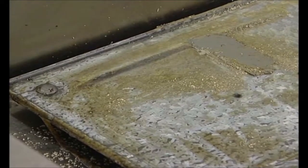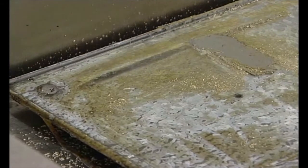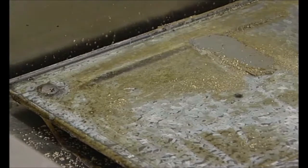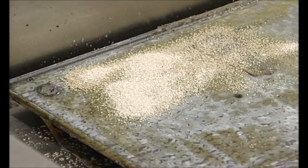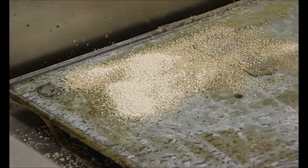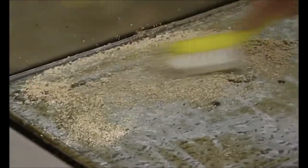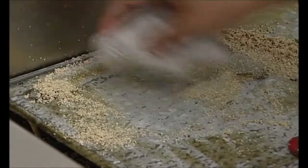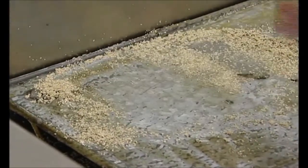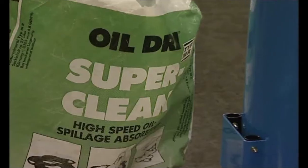When brushing the duct with granules inside, there's some abrasive effect, but the granule should only be used for liquidy type of grease and when there is no heavy accumulation, i.e. less than 600 micrometers, so that you can rest assured to get down to the bare metal. Your worst nightmare is that you only soften the top layer of grease into a liquidy format and a layer of sticky or tar-like grease remains underneath. The granules will then only stick to this layer. In this example, a strong alkaline detergent was put onto hard burned grease first in order to soften it and reach the abrasive effect seen.